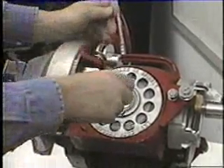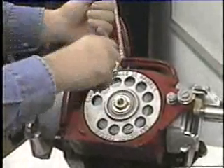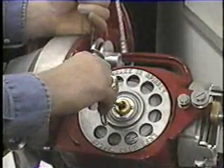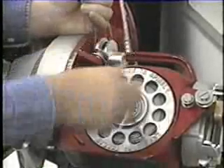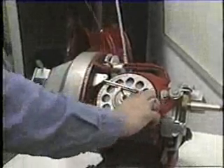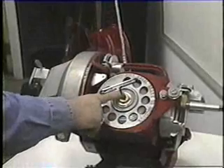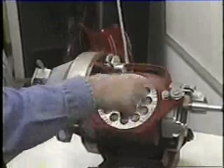After loading the coil of wire on the spool and confirming it is going in the correct rotation, we need to set the brake in the center of the wire spool to the right tension. We do not want too much tension — preferably on the loose side. Put enough drag so the coil of wire will not turn free. That is all the tension, or drag, needed on the brake — it just keeps the wire spool from turning free.